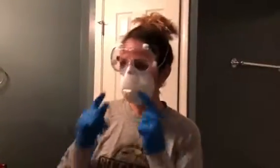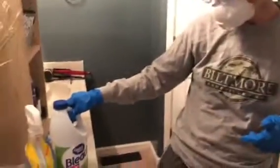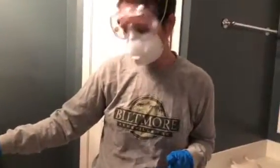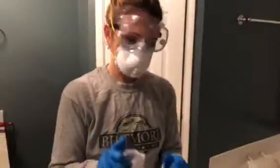And what we're gonna do is we've already turned the air off in the house, because that's what Google said to do. We turned off the air, and we're gonna close the door, and we're gonna pull the carpet back, and we're gonna spray down the moldy areas with a 50-50 mix of bleach and water. And then we are going to let that sit for a minute, and then we're gonna take this scrub brush and scrub the areas that are moldy.